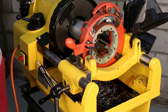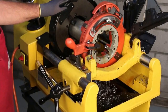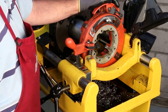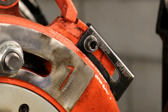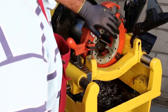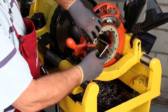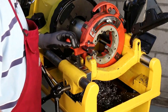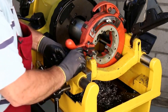For this final demonstration, we're going to cut a set of straight threads on a piece of three inch galvanized rigid conduit, already mounted in the machine. We need to make some adjustments to the die head for straight thread cutting. First, we reposition the lock plate for straight thread operation by loosening the lock screw, moving the plate out of the way, snugging it down — this allows the die head lock handle to fall into a detent. Next, we roll the release foot out of the way and tighten down the lock screw to keep it clear.